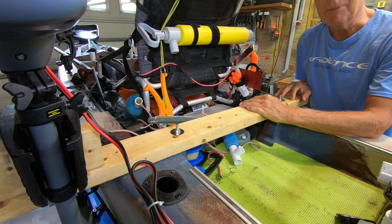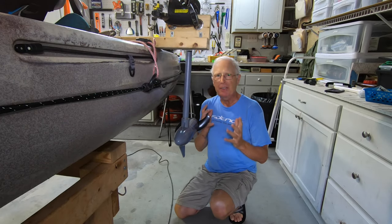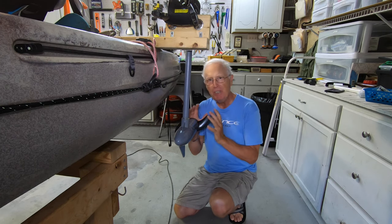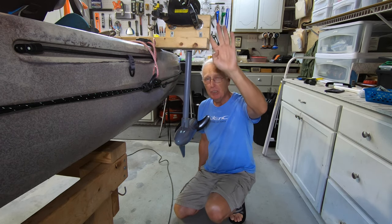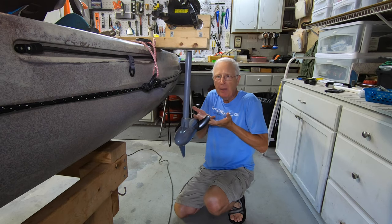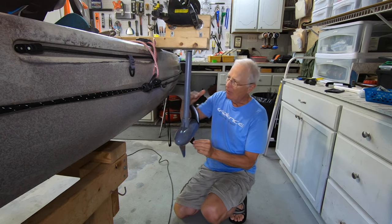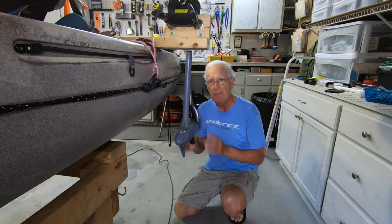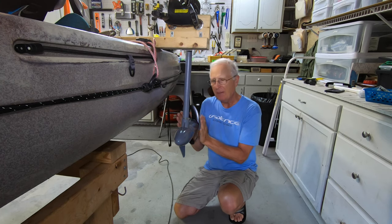Let's go look at the second piece — we've got to go underneath to see that. The second issue, and this is actually the bigger issue, is the position of this thing. Given the junction on the two-by-fours, I've got another inch and a half here that this lifts up out of the water. And this shaft is short — it's only 24 inches — so that puts my propeller too close to the water line and minimizes the benefit I get out of the motor.